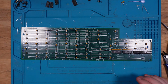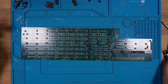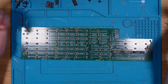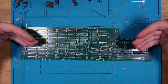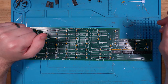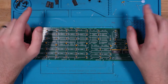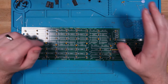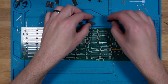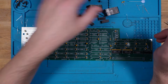Well, next up is really some memory. Now, this is the other part that's kind of hard to get at the moment because this board uses 41256 memory, which isn't available new any longer. So really what you've got is either new old stock or pretty much whatever you can source from China, which is what I did. I do have a whole bunch of new old stock, but not enough to make the entire system. I could probably get about half with the stuff that I actually know is new old stock. And unfortunately, I'm just particular, I want the whole board to be matching RAM. I know saying coming from China isn't matching RAM necessarily. It is a bit of a gamble, but it looks like the order that I got is actually pretty decent. So I did put in a big order for quite a number, and they came, well, not exactly in the best packaging.